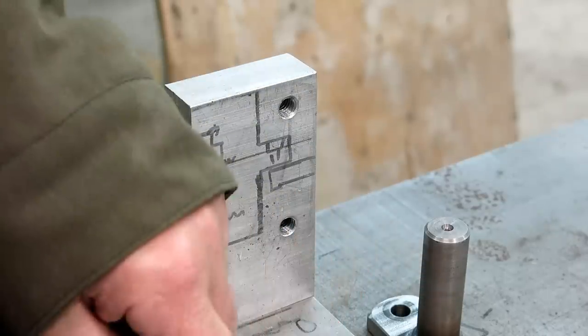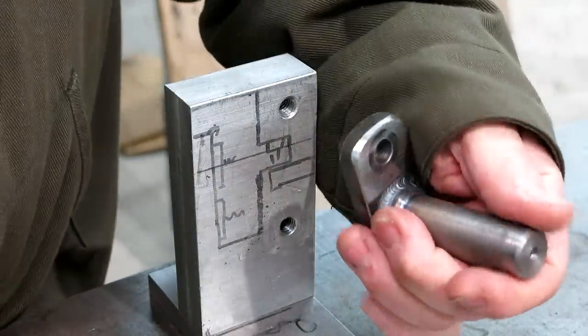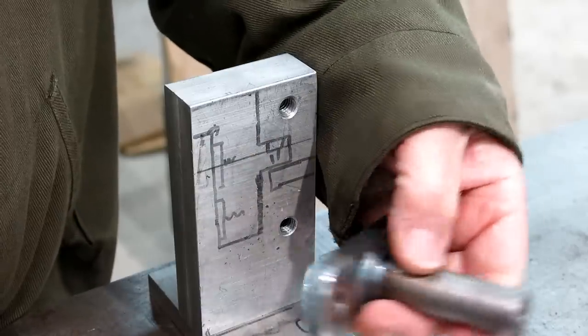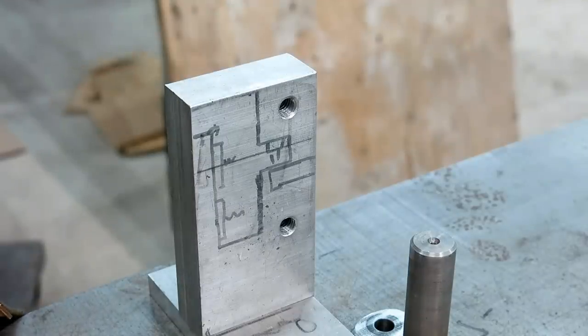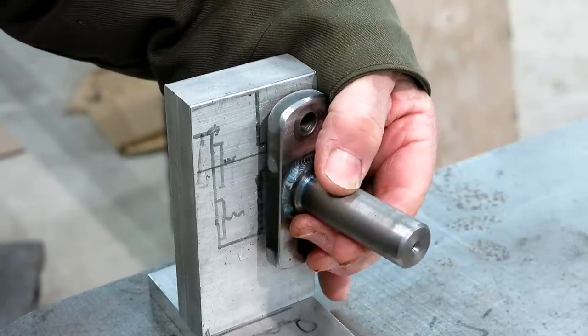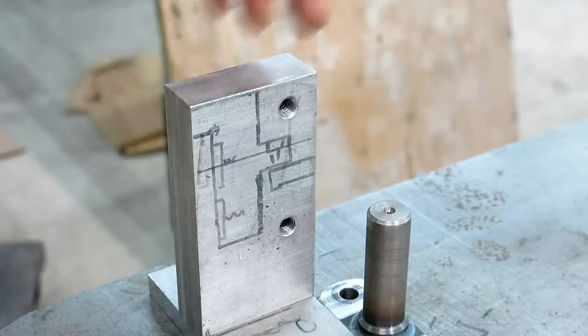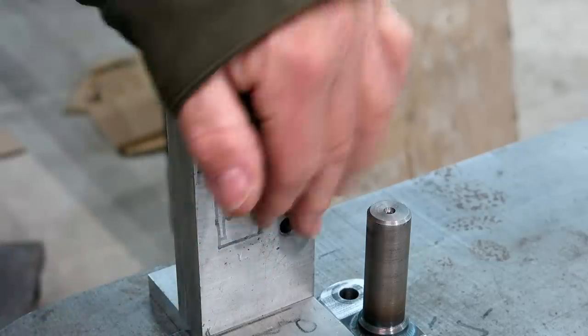I like this one. I also like this one. So I'm thinking I might want to put both of these on the come along as options. It has a little stump that I can grab onto with my hand, or use a tube on or whatever, and I can slip into a stock pocket or a stock-like pocket, and off I go with that. But this needs to get redesigned or beefed up a little bit, and then this one, we either have to drill through and put nuts, or maybe replace these with helicoils or something like that to give a little bit more thread strength there.